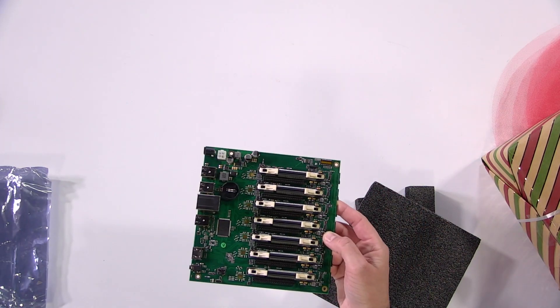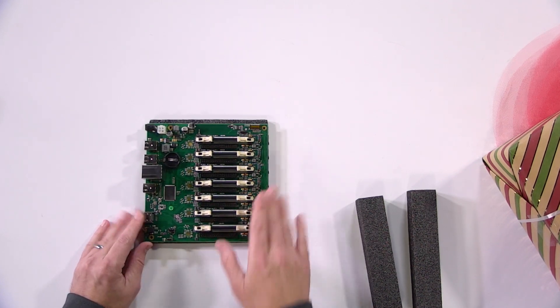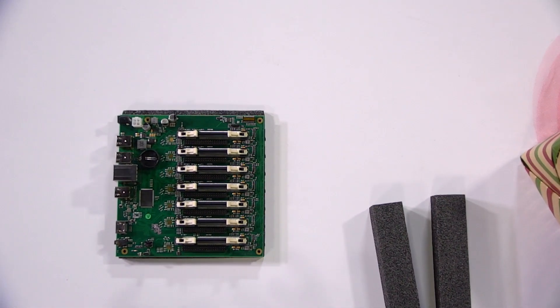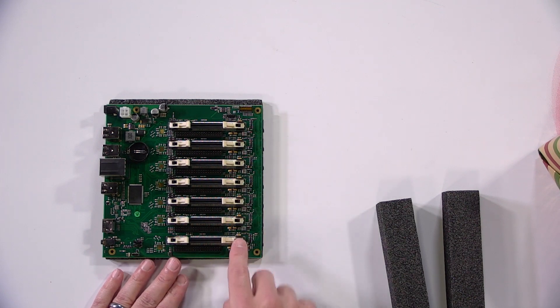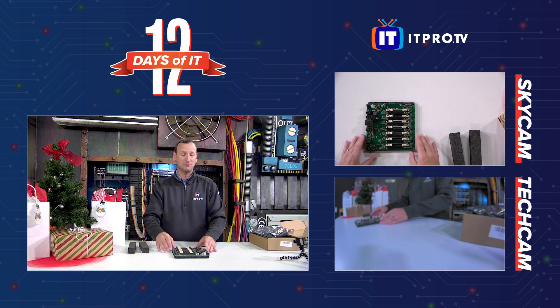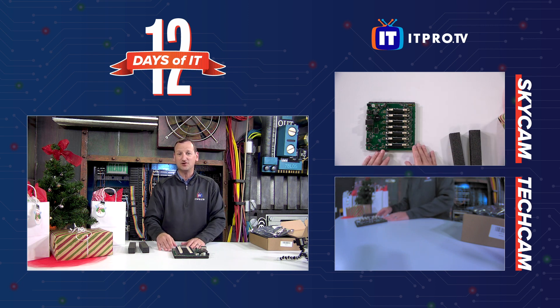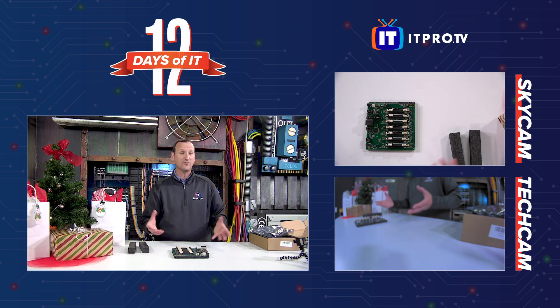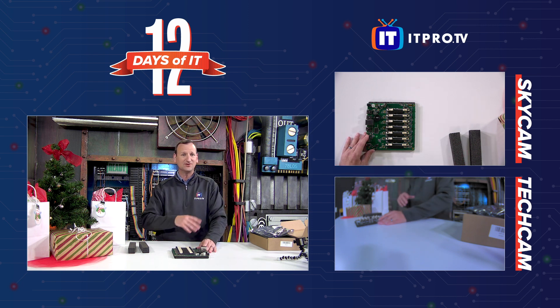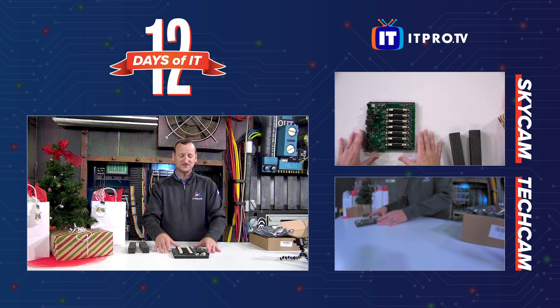Let's take a look at what we've got. First off, it lets us build a cluster out of seven Raspberry Pis. Now, Raspberry Pis are normally independent cards, but they make Raspberry Pi compute modules — CM3s — and what they are is an entire Raspberry Pi in a memory stick form factor like an SODIMM. We can pop seven of those right in here to build an awesome cluster for messing around with Kubernetes, Ansible, and all sorts of other cloud and rapid deployment technologies all in one single form factor.